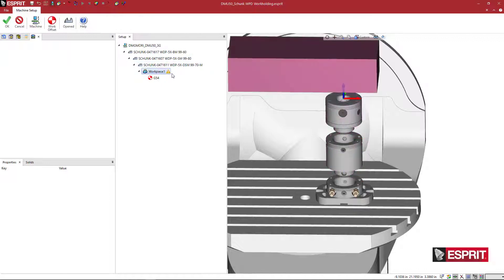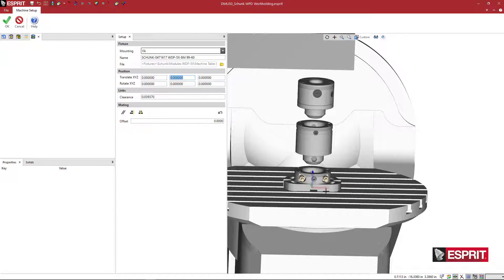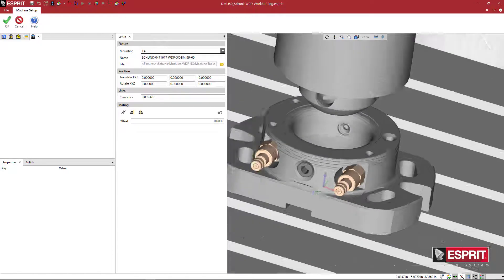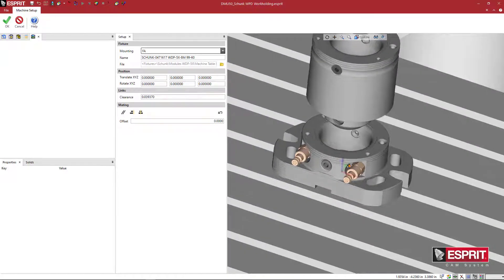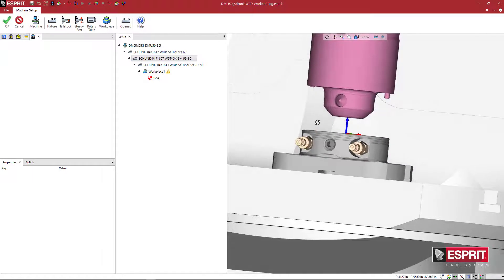Then we would mount the workpiece to the top. As I go through this, you can see that the table reference point is the center, and I'm shifted at 4.25 over. If I zero this out when I make my base unit, we want the base unit sitting wherever I want that reference point to appear. Now the next workpiece — when I define my next fixture adapter position, you can see that this is on this base piece.